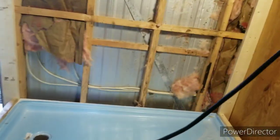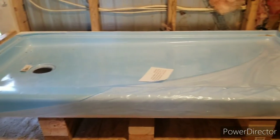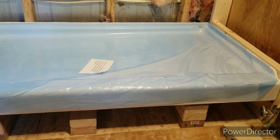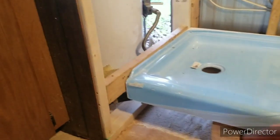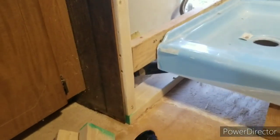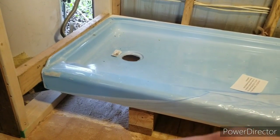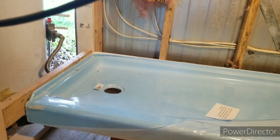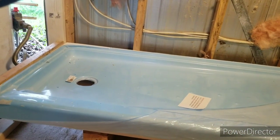It is Sunday morning. The basin is here — this is just the test fit. I'm trying to find exactly the height I need to be at. I need to get some shims to bring it up just a hair to get everything squared away. I've had to bring this wall section in an inch and a half — you can see where I cut out the loop — because this basin is actually more narrow than the factory tub. Had to take that wall all apart and rebuild it again and bring it in an inch and a half.